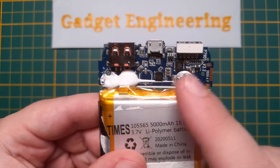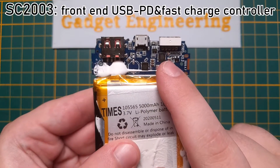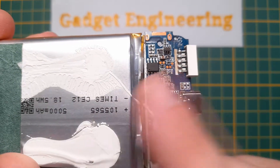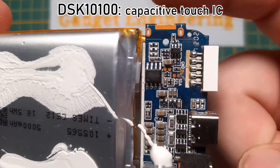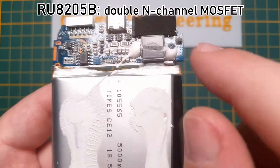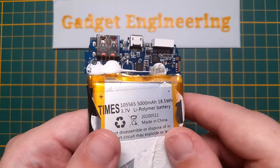We have two South Chip branded packages with a large number of pins. One is handling the buck converter through this 2.2 micro-henry inductor, and the other large chip is handling the power delivery system. On top of that, we have a chip handling lithium protection — basically a big MOSFET doing overcharge and over-discharge protection. There's also a small chip coupled with the capacitive touch area, which is the capacitive touch IC. Then we have a bunch of small double MOSFETs, 8205s — four on this side and another one up here — 20 volt, 6 amp double N-channel MOSFETs doing overcurrent control and disabling outputs if something's not right.